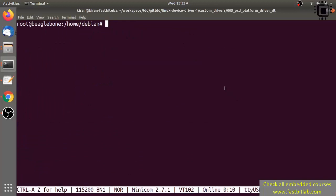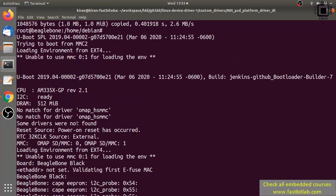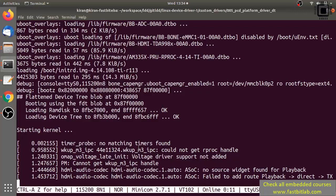To recover the MBR, log back into the BeagleBone and use the dd command: input file is emmc_boot.img (the file saved earlier), output file is /dev/mmcblk1, bs=1MB, count=1. This recovers the MBR. Then remove and reconnect the USB cable — the board now boots from the eMMC again. Throughout this course we'll be using SD card boot and won't be using any contents of the eMMC. I hope you can reproduce this at your desk and I'll see you in the next lecture.